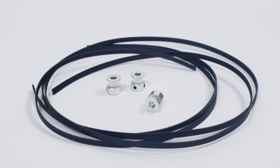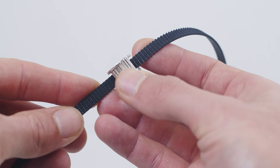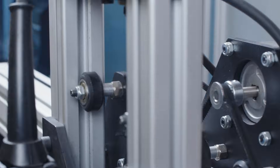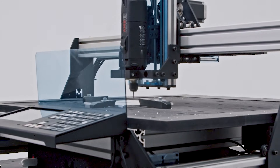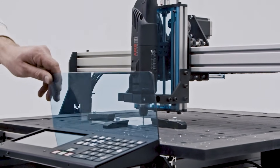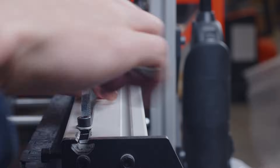Timing belts are often used for lighter CNC applications, like 3D printing or laser cutting. But with a proper setup, they are definitely able to handle milling too. They allow an entry into the CNC milling world without the higher cost of advanced drive systems. Belts are exposed to external conditions, so you should regularly check their integrity and soiling.